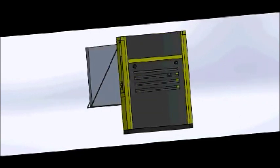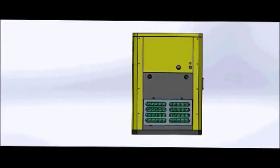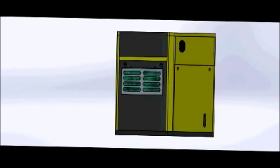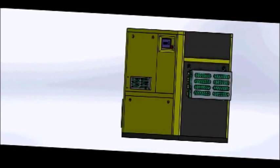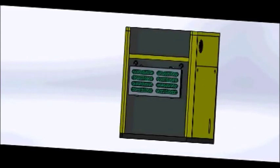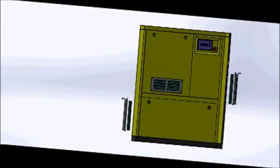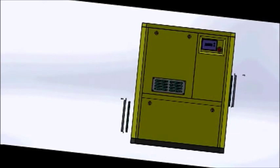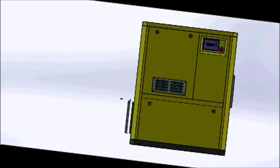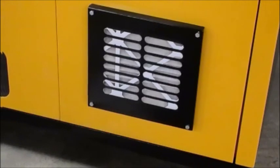Manufacturing a reliable compressor is the foundation Polar Air has been built upon. Even in the cleanest of shops, inlet cooling air is littered with fine dust and debris that over time accumulates on key compressor components, degrading their cooling efficiency. The most notable component impacted by dirt buildup is the compressor oil cooling and compressed air aftercooling radiator. The dirt buildup serves as a barrier inhibiting the radiator from working as designed. Polar Air offers a pre-filter inlet option, with inlet air filtered within a MERV-8 rating. The pre-filters are easily removed and reassembled, saving you costly maintenance and downtime.